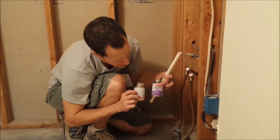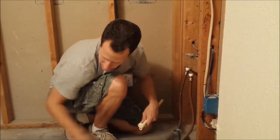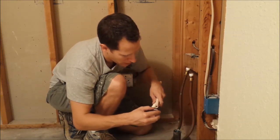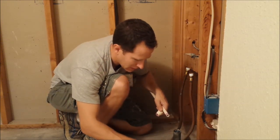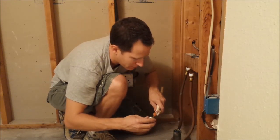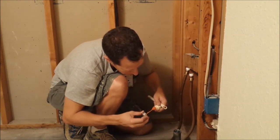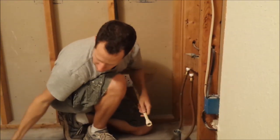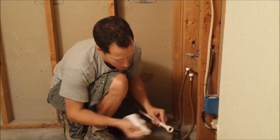There are two products you use with PVC: this purple stuff and the orange stuff. The purple is basically a cleaner/primer, and the orange is a glue. I'm going to take this pipe, make sure it's clean, then take the purple stuff and wipe it along the outside — this purple stuff actually eats the PVC a little bit and cleans it. Then you get the orange goop; it doesn't need to be dry from the purple. Put a good amount of the orange all the way around, put a touch inside as well, making sure you get a good seal everywhere. Take the two pieces, stick them together all the way down, then wipe off any excess glue that pops out because of the tight fit — that way when we're done it's nice and clean.